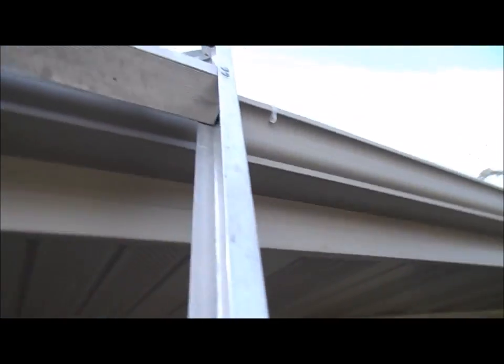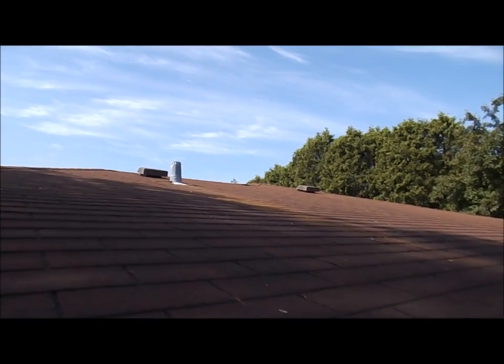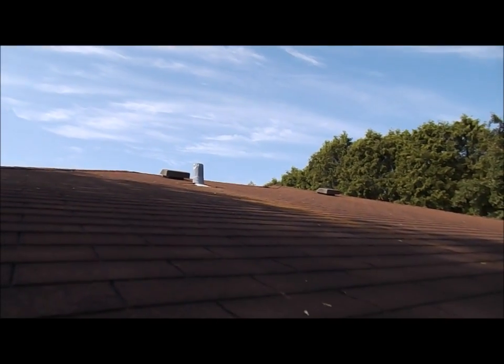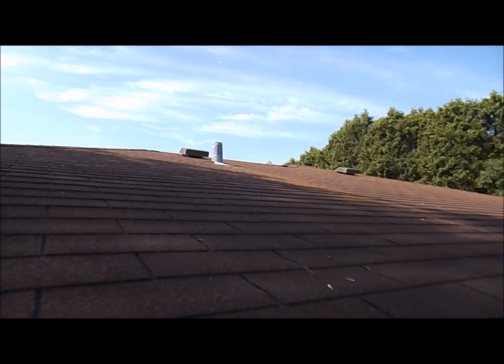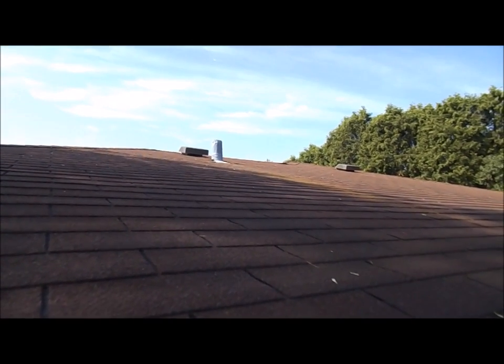We never used a vent because as we get to the roof here, you'll see next to that stack pipe there's never been a vent. I was up in the attic and I checked it, and whoever installed it just stuffed the vent part of that heater exhaust fan with insulation. And there's no holes in the roof sheathing, I guess is the word.